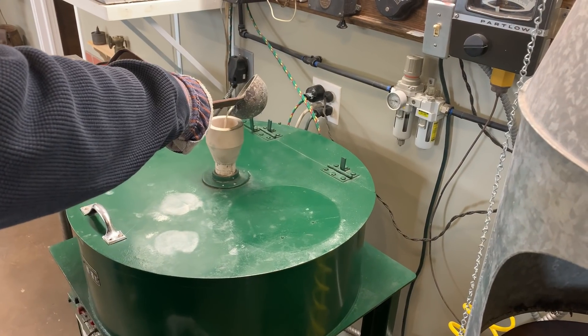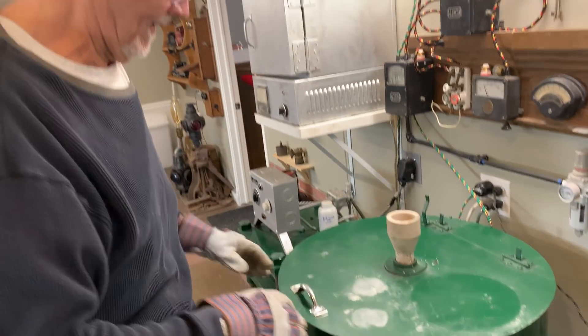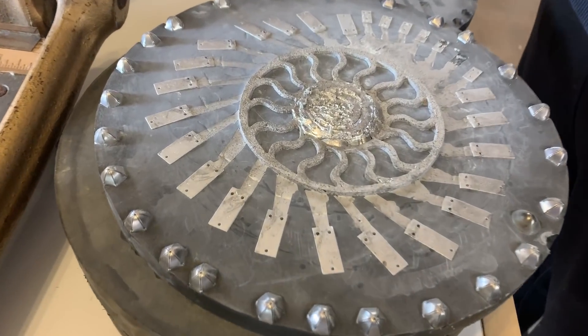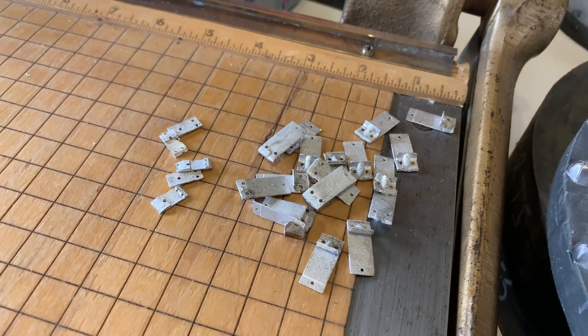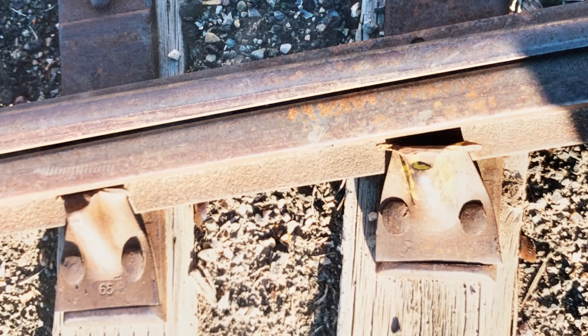Last week we were casting the bits and pieces needed to lay switches in the switching yard. We have a complete casting setup here in the garage, which is not the sort of thing most people have. What we're casting are point slide rail braces. Last week I inaccurately said that Llagas Creek no longer makes them — Brian and Mike said no, they still make them, they were just out of stock. But we still cast our own. This is what they look like on the real railroad — they hold the stock rail from being pushed out of gauge by the points and the force of the train as it's coming through the switch.